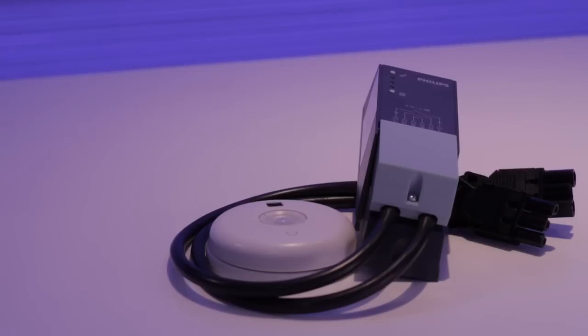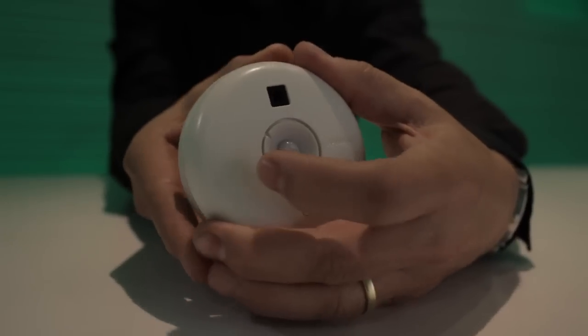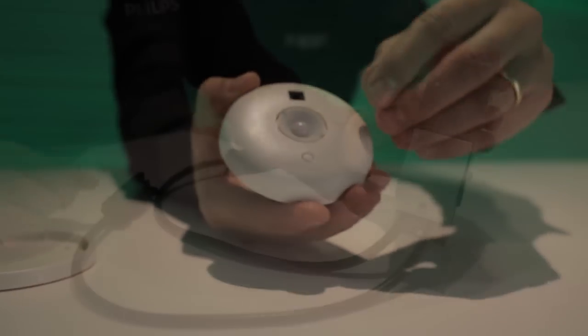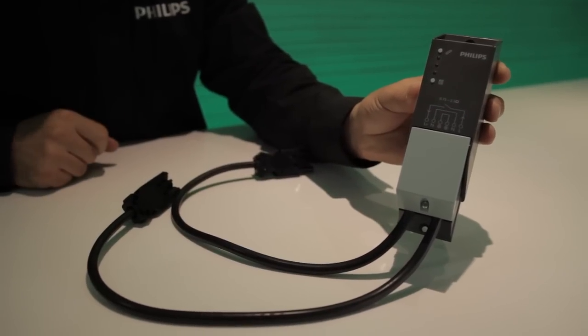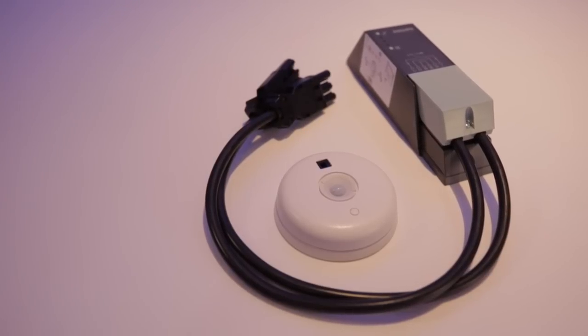The second range is the OcuSwitch wireless, designed for easy installation in any application. This advanced wireless sensor turns off lamps when the area is unoccupied. The wireless sensor requires no cabling as it has a battery designed to last at least 10 years. The actuator switches up to 6 amps and can be located anywhere in the ceiling or riser. Up to 10 sensors and actuators can be combined on one system. It is a unique plug-and-play system for retrofits or new installations, providing energy savings in offices, corridors, storerooms, and toilets.